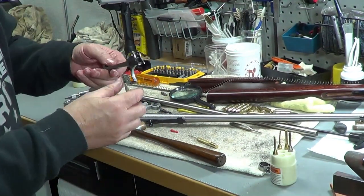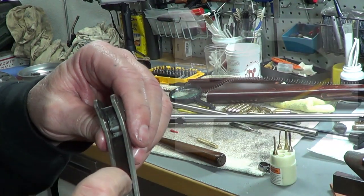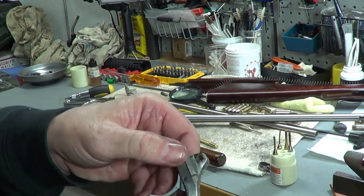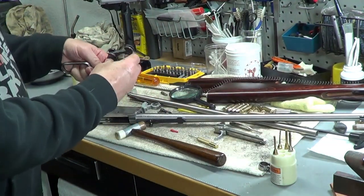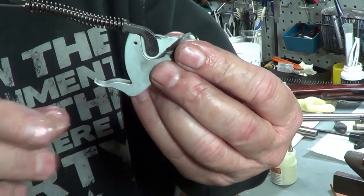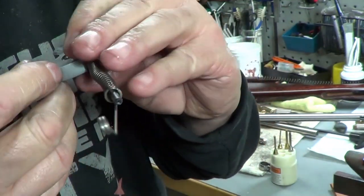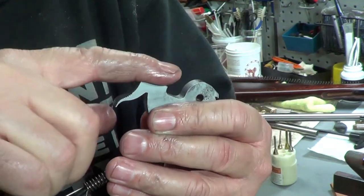So that's my lever. This is the bottom tang or something with the trigger. This is your spring that some people change — I'm going to take that out and polish it on both sides. This feels pretty rough right here. The trigger is pretty smooth. And then my hammer with the spring — these are pretty smooth, and the trigger was pretty good on here. So I'm going to polish up this side and that side, and anywhere else I see wearing.